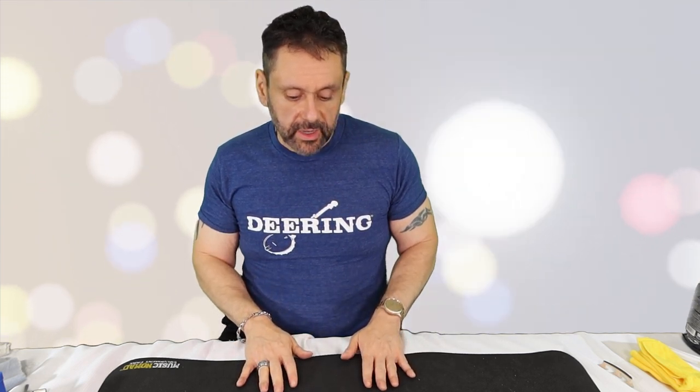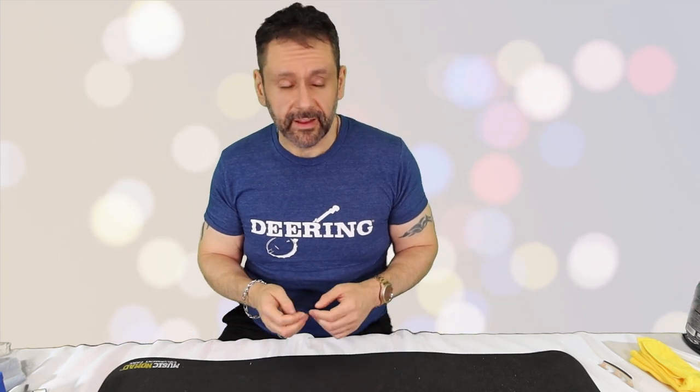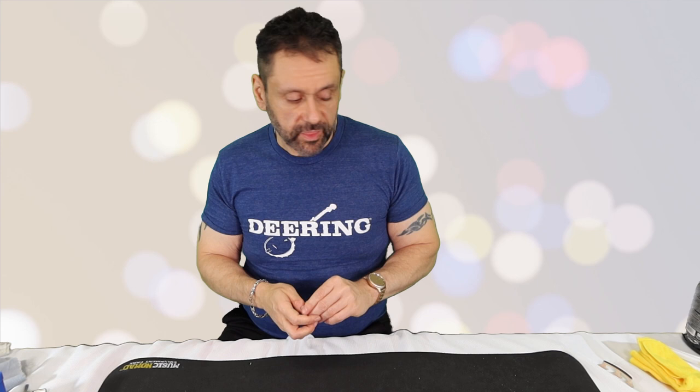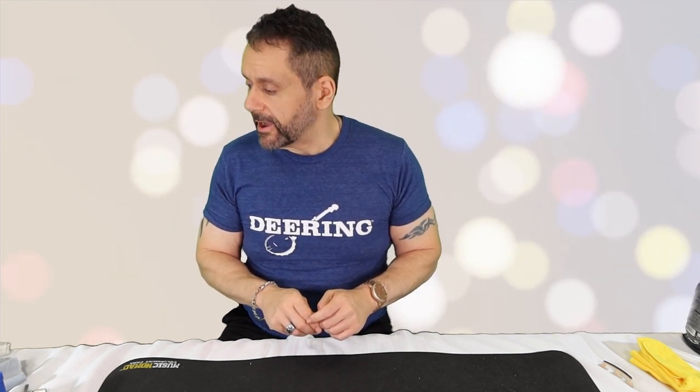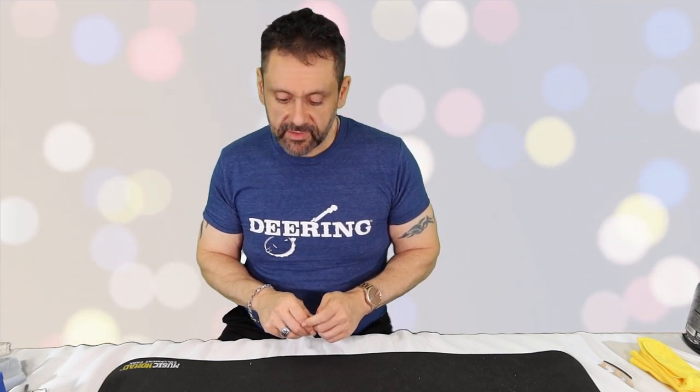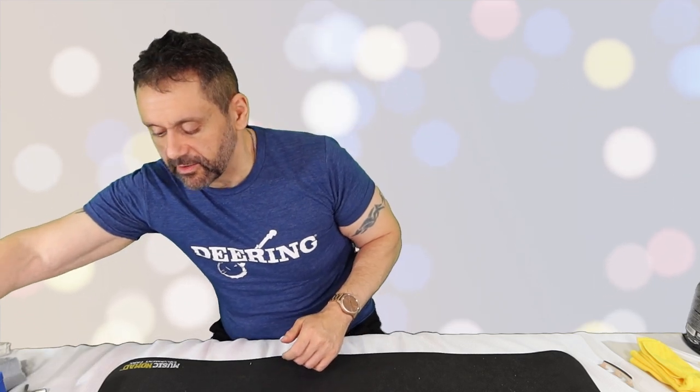But I have a rather unorthodox solution. You can go to a hardware store or perhaps a Harbor Freight store and buy a vibratory parts cleaner. It's just a machine that has a bowl and it's meant for cleaning nuts and bolts and screws and things like that. You could put your parts in there along with the appropriate cleaning medium, such as crushed walnut shell or crushed corn cob. And the machine just vibrates the parts together with the cleaning medium very, very fast. And it cleans and polishes the parts all together in a very rapid manner.